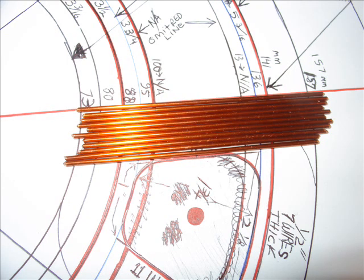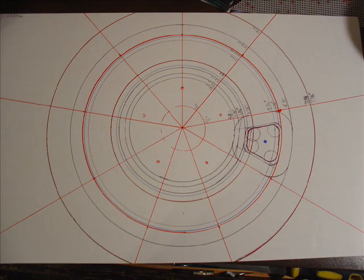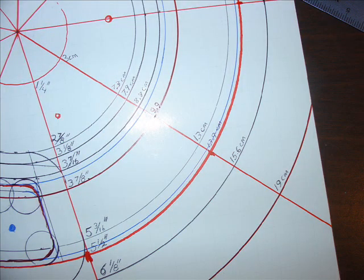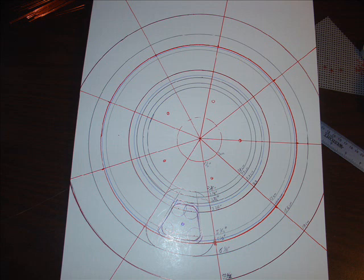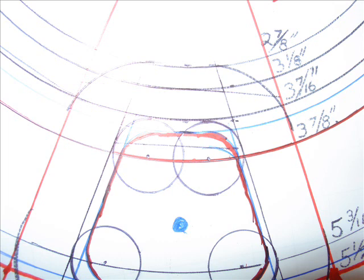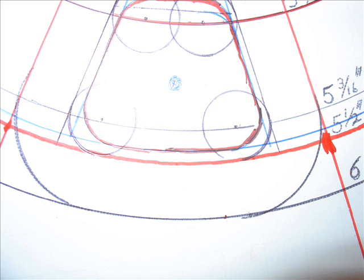All this is documented. So this is not the actual drawing we're going to be using — just a little slide show here. Those five dots in the center are for the lugs. The good thing about this is you get a nice hub spindle and bearing, and then two brake disc rotors, and 24 neodymium iron boron magnets — one inch by two inch by half inch — 12 of them going on each rotor, facing each other.